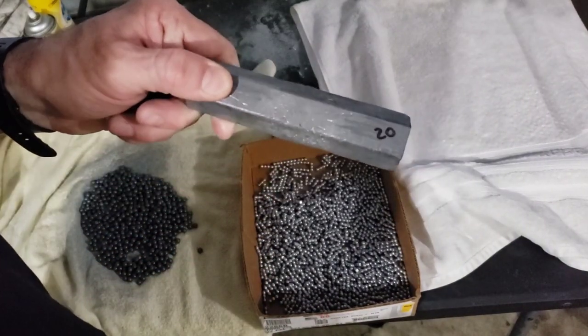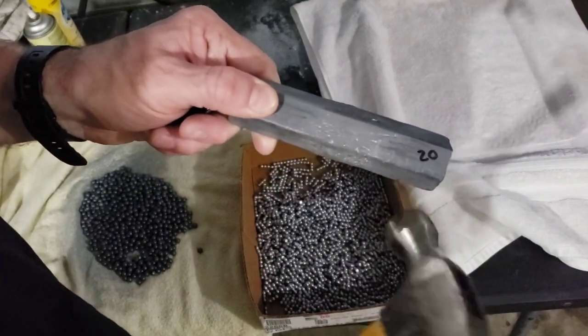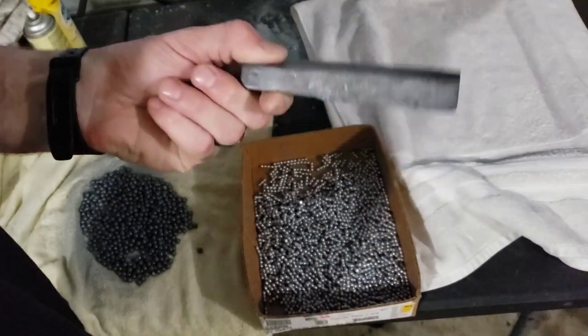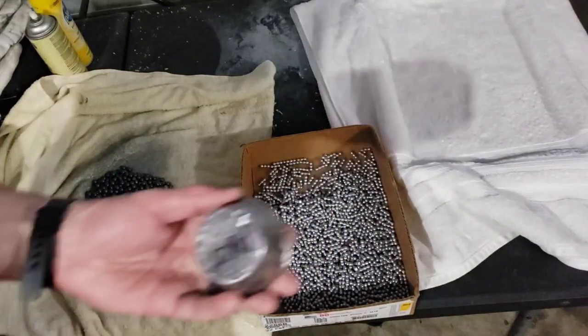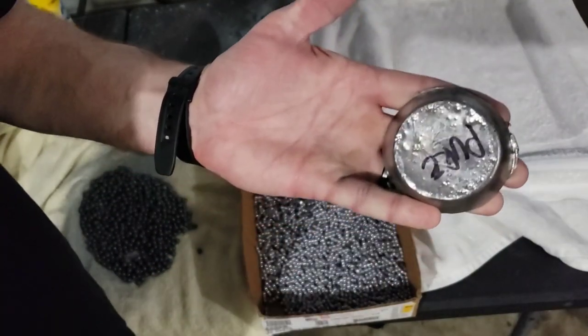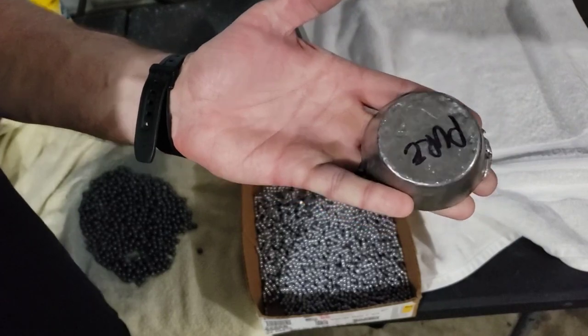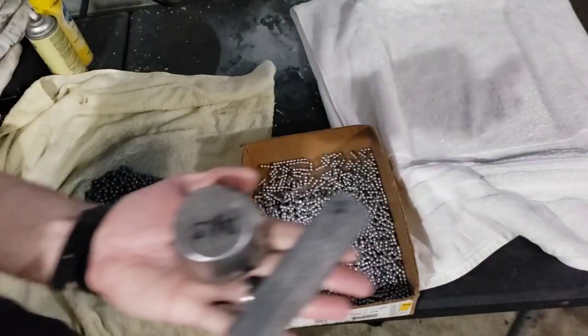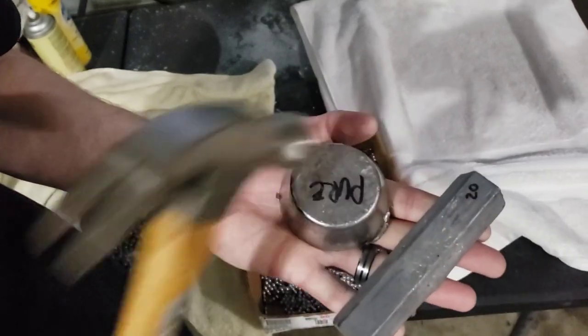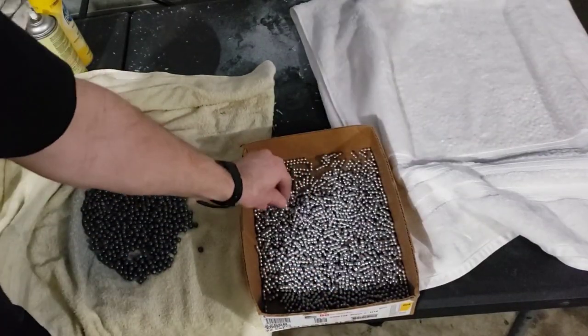You need hard cast, water chilled — and you can hear how they ting rather than clunk. That's an indication of hardness. This one is approximately 20 BHN. Sounds like a steel bar. Here's a pure lead ingot — tink, tink, or clunk rather. One more time: tink, tink, tink versus clunk. Somewhere in between that is what you want.